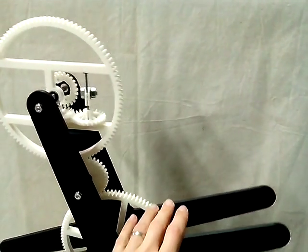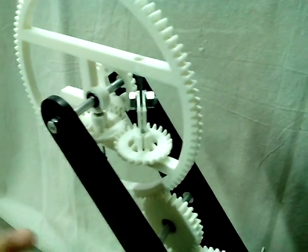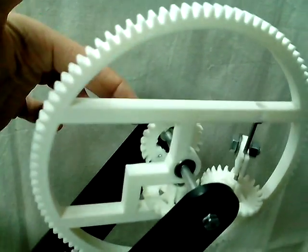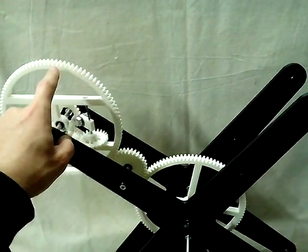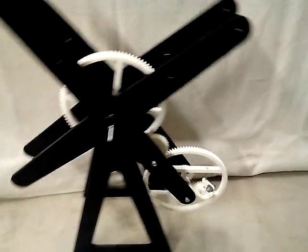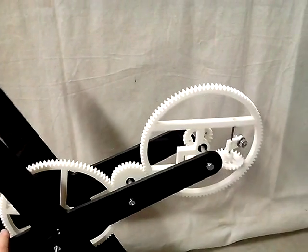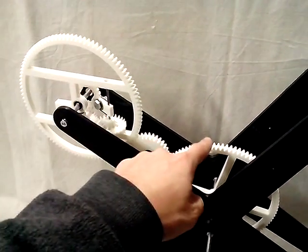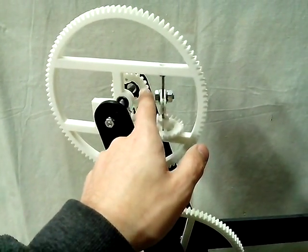I learned a little bit and had fun printing these large wheels on my printer, so it was a nice little diversion. There's really not much to it — this right here has two bearings, there are some bearings that the gear rides on, and the outer gear is basically bolted directly to the frame so it doesn't move. The fact that these two large wheels are the same diameter makes it stay level the entire rotation. It really didn't matter what size this gear was going to be. There are only about four printed parts on this thing.